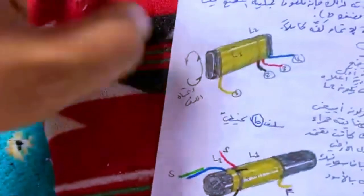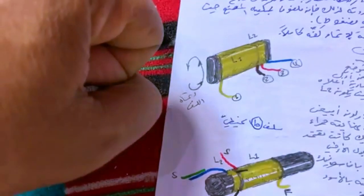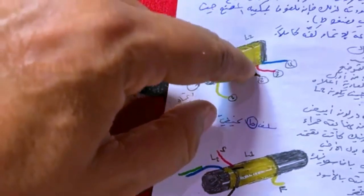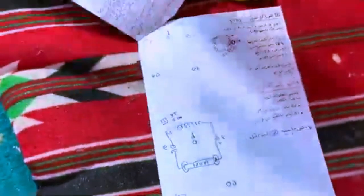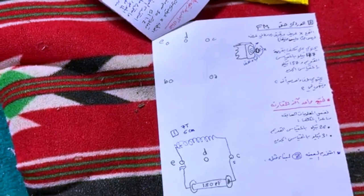What I want you to do to get the correct RF inductance is to leave some space — about one millimeter — in between the two. But if you just put them together like I did, you will get a very high inductance coil, and you will find yourself forced to drag it out of the right route to get the correct RF inductance. So from the beginning, just leave a space in between the two.